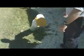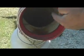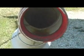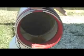This is a dry hydrant. It's called a dry hydrant because it's dry. There's water down in there, but it's down at the level of that pond. It's not pressurized, so we have to draft out of this. We have to suck the water out.